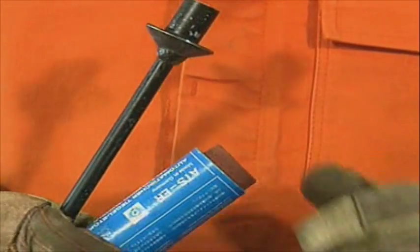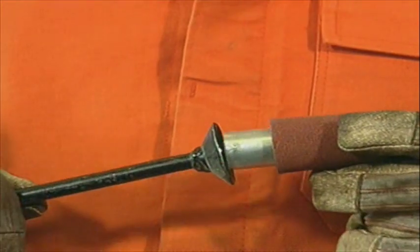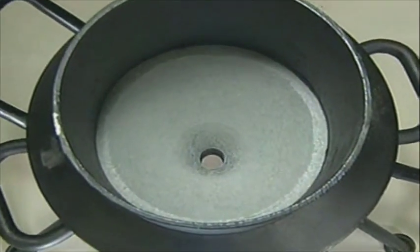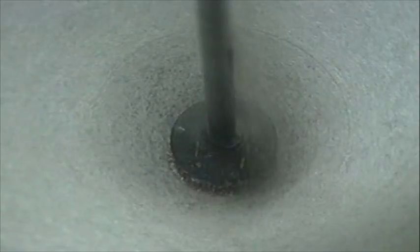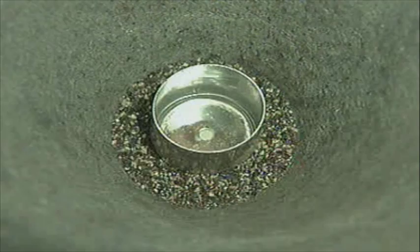Insert the clean magnetic end of the applicator into the metal sleeve and close the thimble opening of the long-life crucible by the thimble. Distribute the plugging sand evenly around the tapping thimble. No plugging sand and no foreign body are to be within the metal sleeve. Now lift the applicator vertically and fill in the welding portion.